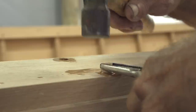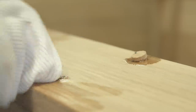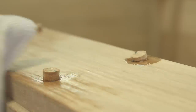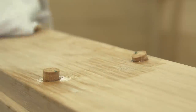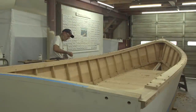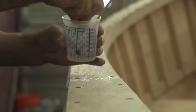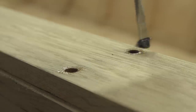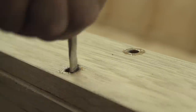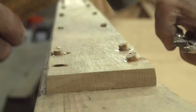You have to wipe around the plug right away, because if you don't, you have a puddle of epoxy that dries, and then not only do you have to clip the plug off, you have to clip off the dried epoxy too — it makes it two or three times harder. I'm on to the port side now. I learned something with this brush about priming the holes: I've got the bristles cut really short, and to get it down in the hole you just lay it alongside the hole and fold it over into the hole.